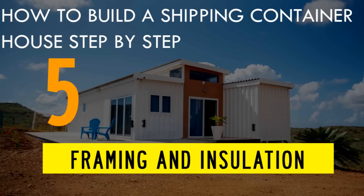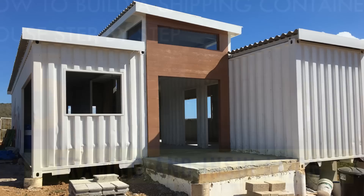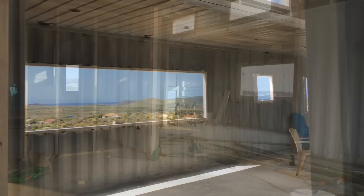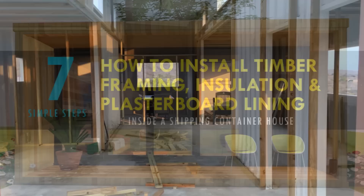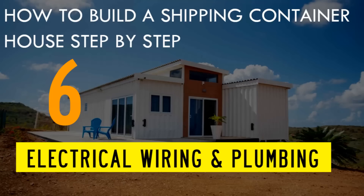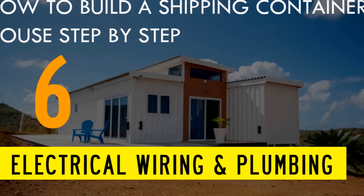The second-to-last step when building a container house is framing and insulation. With the exterior complete, it is time to move inside. The entire house was given a new floor finish — a concrete floor was cast on top of the container plywood floors before framing the interior. Shipping containers are made from corten steel, so it is not possible to attach plasterboards directly onto the corrugated steel walls. Pre-treated 2x2 timber studs are used to frame out the container walls and install interior partitions to demarcate all the indoor spaces. Once the wall framing is complete, the next step is to install electrical and mechanical services.